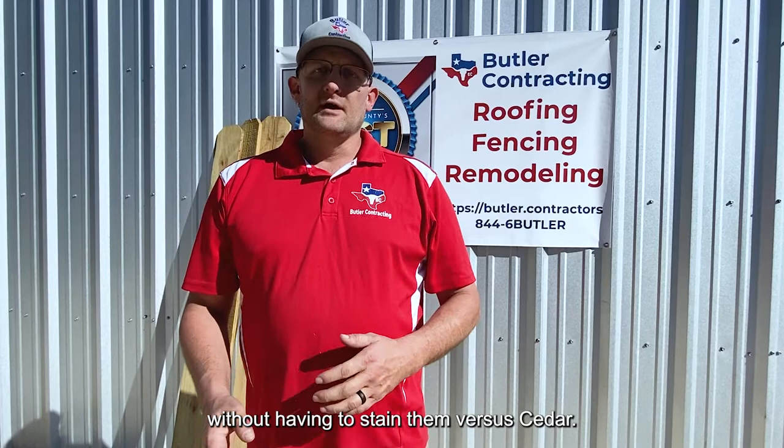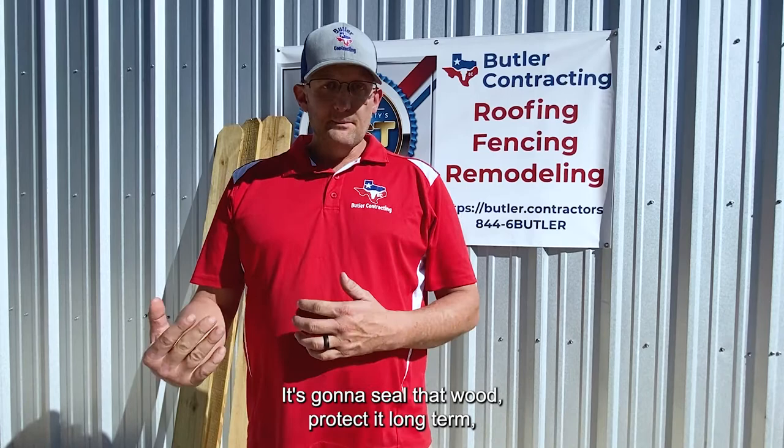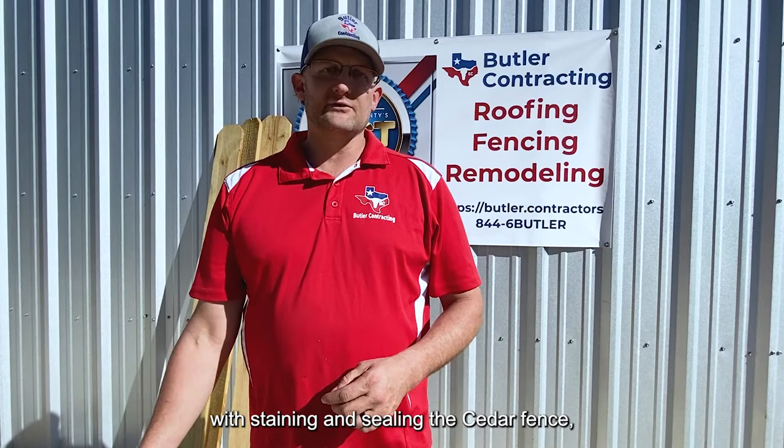I would definitely recommend, if you're putting a cedar fence in with cedar pickets, that you get it stained within the first few months of installation for sure. It's going to seal that wood, protect it long term, and you're going to protect your investment long term. The issue you have if you don't move forward with staining and sealing the cedar fence, when you put it in, you're going to see breakdown in that product.